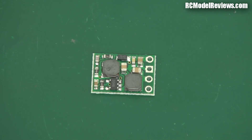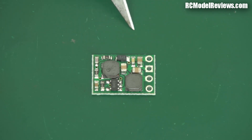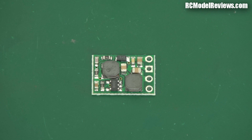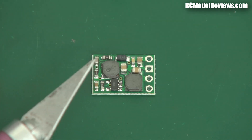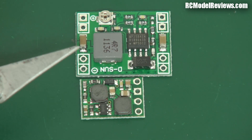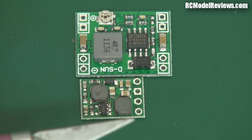The other one here is a Pololu — what a name — and it's a step-up step-down voltage regulator, also called a boost-buck. This works differently because it gives you a constant output — in this case 12 volts — regardless of the input voltage. You can buy them in five volt or 12 volt flavors; it's not adjustable. If you're running from a three-cell pack and your battery drops to nine volts, it still gives you 12 volts by boosting the nine volts up. If you're on a four-cell pack at 16 volts, it bucks it down to 12. You can tell a boost-buck regulator because it has two inductors — those little gray round things — whereas the plain buck regulator only has one.